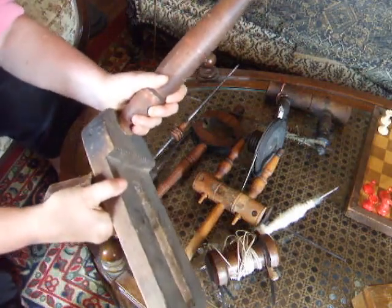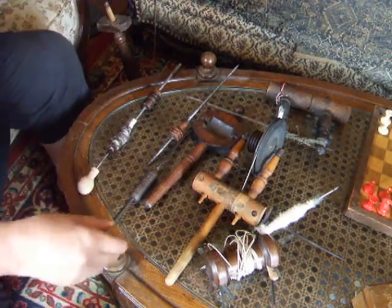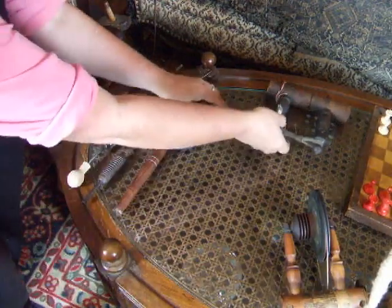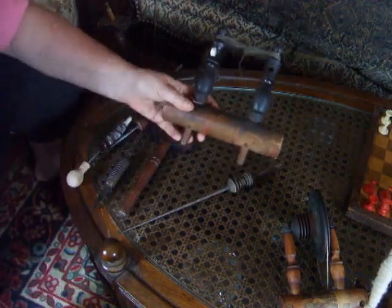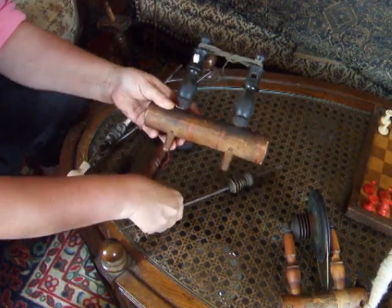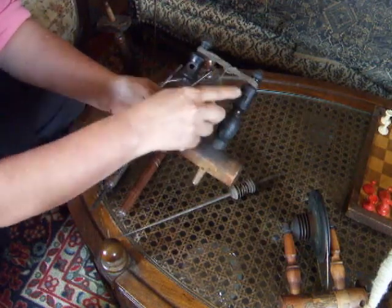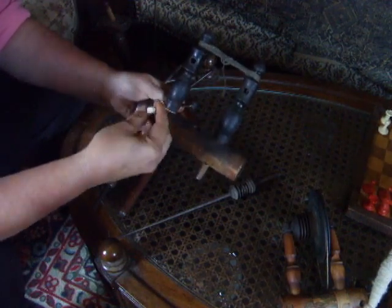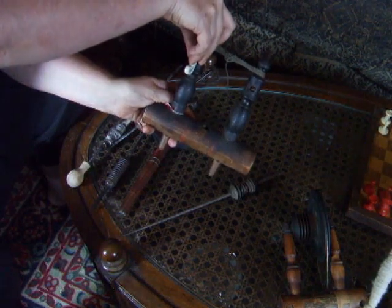What I've gotten is the male mount off of my most commonly used great wheel, because I'm going to show what we're talking about with mounts. So, this is the upright. How do you attach a spindle to a great wheel? There are a number of ways. The most common way is with a mother of all and maidens or sisters, through which you often have holes drilled. If there are not holes drilled, then you're going to tie on the bearing that I'm about to show you how to mount.